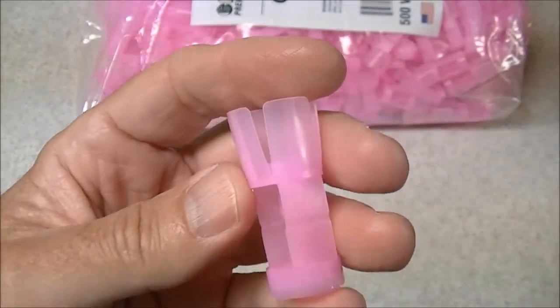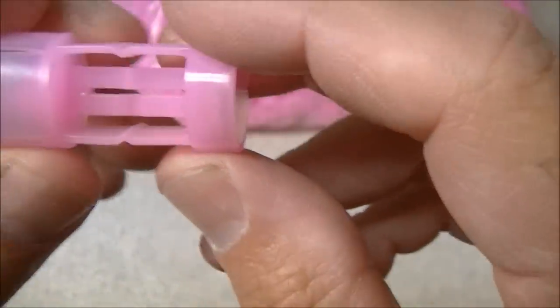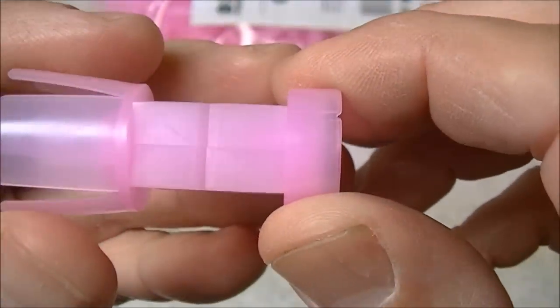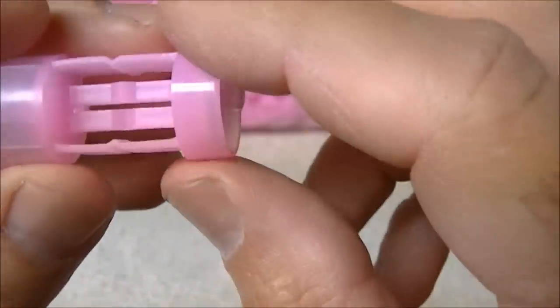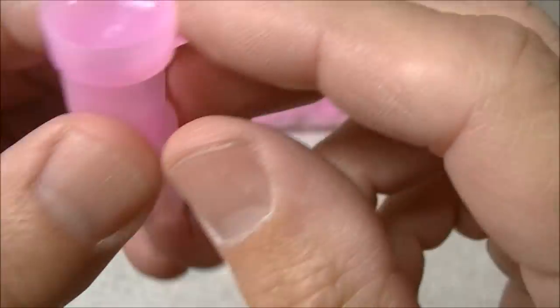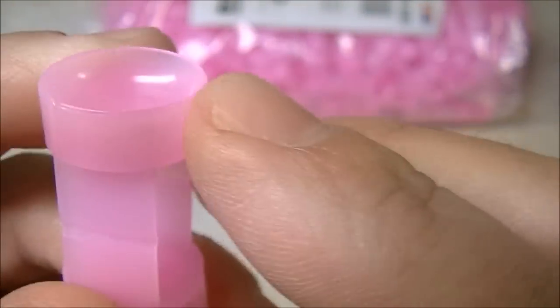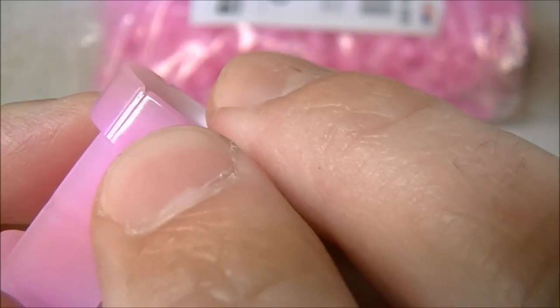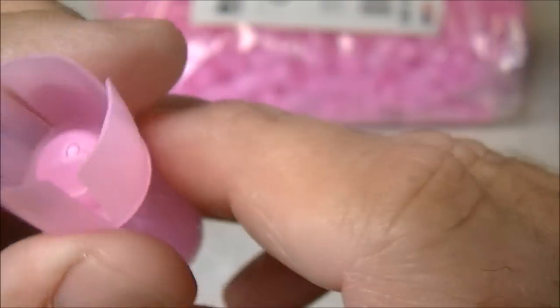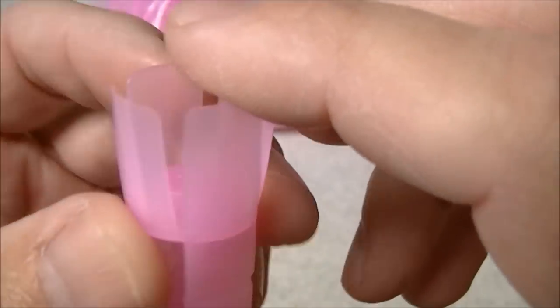Having a closer look at the wad itself, it is a Winchester style of wad. You can see it's got the collapsing legs there and it has a very large center section. This is basically 3/4 of an inch of space between the shot cup and the gas seal. These are a Winchester style wad because of the overall design with that cushion section in the middle with the legs, and they have a bit of a tapered gas seal section. You can see there's some minor flutes in this to let air out when you're seating the wad, and a fairly short shot cup section, which is appropriate for the very small payload.